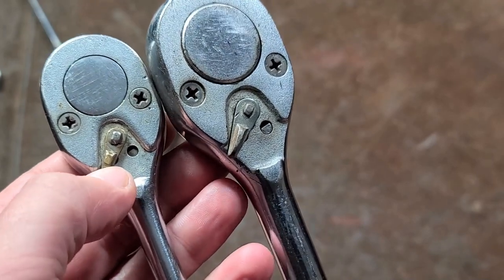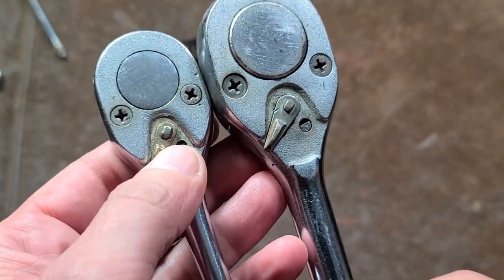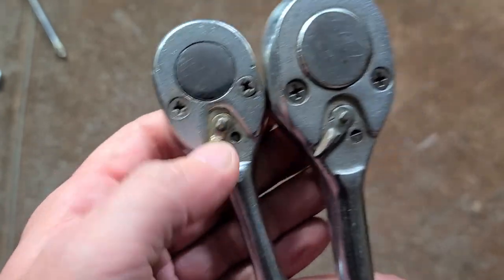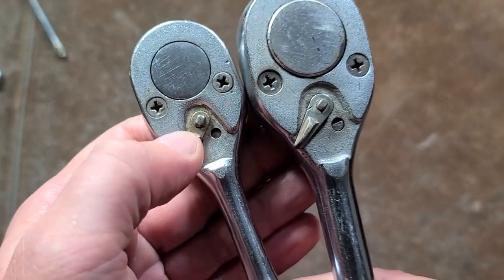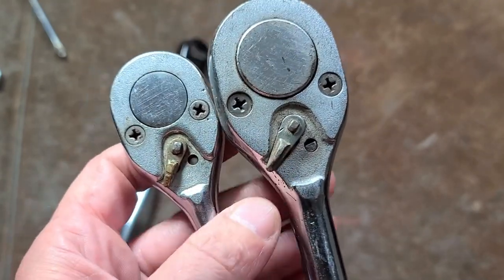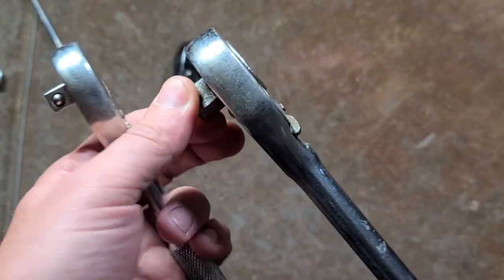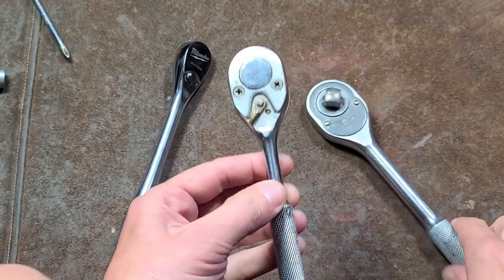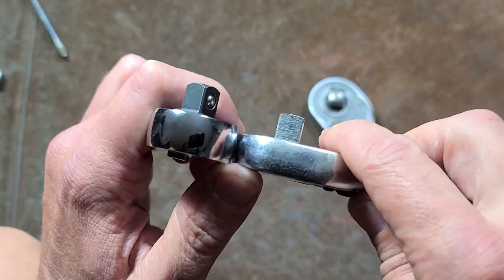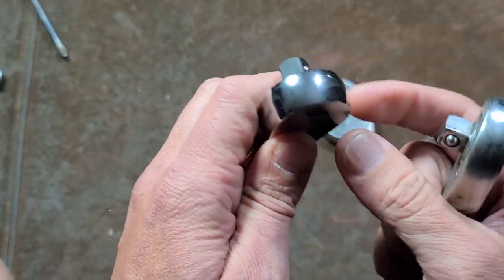So you could even see a little bit of a quality drop. When you're stamping out these little switches, the overall manufacturing costs due to tooling wear mean you don't need as heavy-duty stamping presses. Brass, even though it's a more expensive material, is actually overall cheaper than making them out of heavier-duty steel. To tell you the truth, there's only been a few Proto ratchets I've really been a fan of. The only saving grace of these is they do have a pretty thin head — it seems older ratchets were just a little bit thinner, reducing the width of the head and making it a little bit taller.